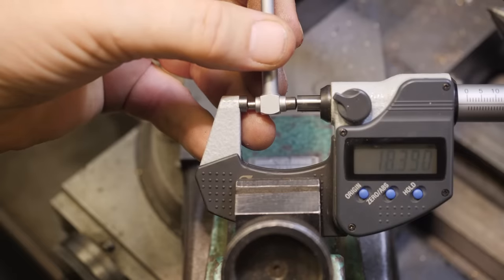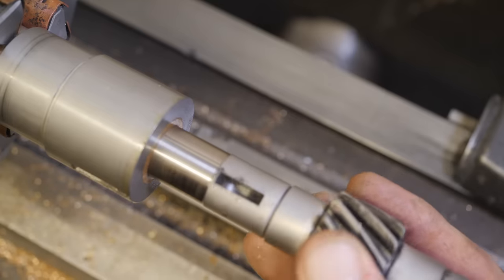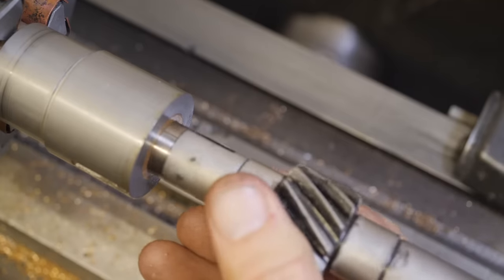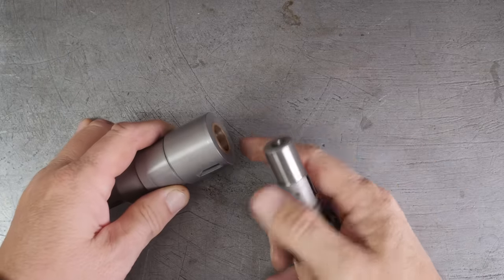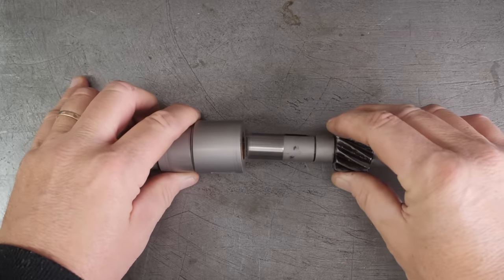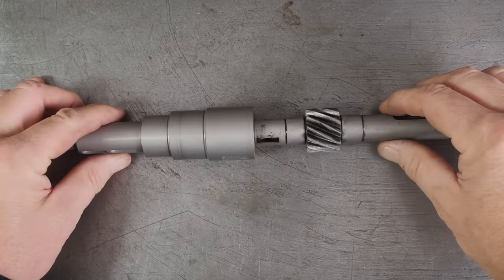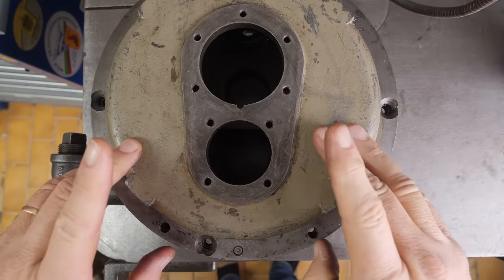Okay, so that's now nominal to the shaft. So do I take another shot at it to open that clearance a little? Although my bore gauge measurements say that this is basically a transitional fit and should be very tight, in actual fact, the way these slide together, I'm guessing this is probably the clearance that I was aiming for. So I'll stop there. Cool, let's start stuffing that gearbox.